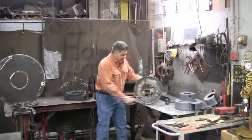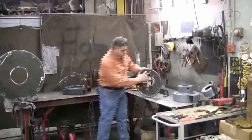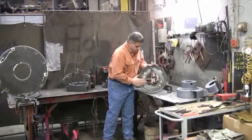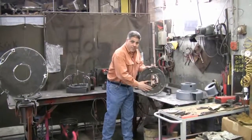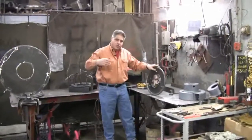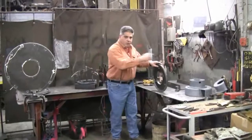This is the beginning of a gas base for an Inferno Therm burner. This is the void that the gas supply goes through and the gas ring, which creates a spiral pattern — as we spoke about before — that gives us the spiral down the fire tube so that the fire scrubs the inside of the fire tube all the way down.